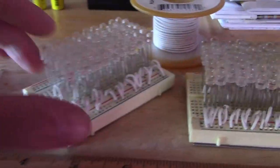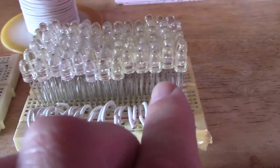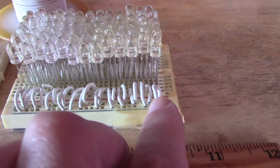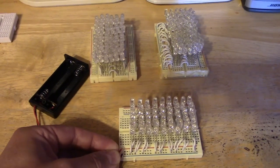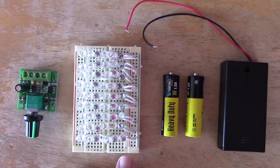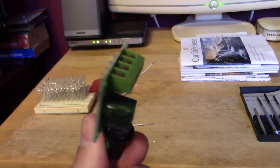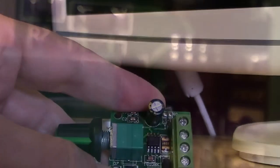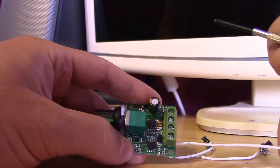Connect all ten of those holes with jumper wires — two of those — and then three more diodes. That's it. Then just do the same thing all the way down. This one is nine with a set of holes in between each one — you see the gaps. This one is exactly the same except no gaps, so I put 13 in a row and wired it accordingly. To connect the power source, just take the positive and negative leads from either the battery cradle or the transformer and drop them into the power rail. The breadboard was five bucks and I get the diodes in packs of 100 for about 20 bucks.